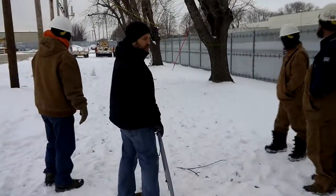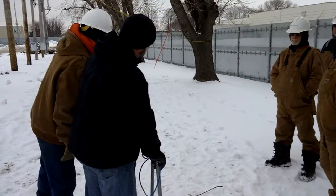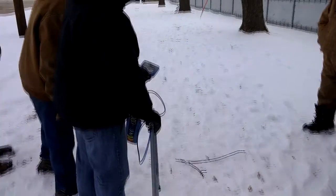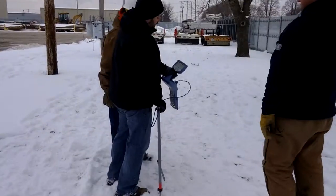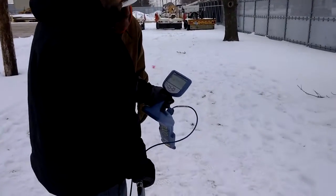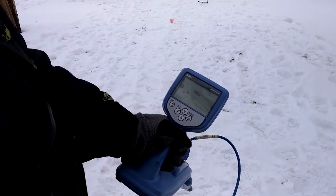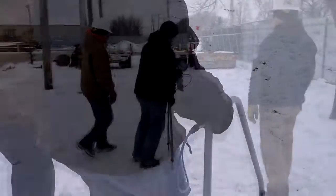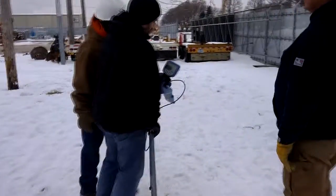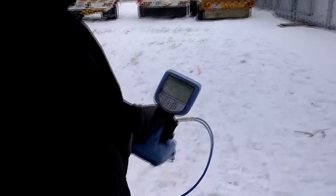You can see we already have red marks on the ground, so somebody's already located the path. Now I'm getting a 43 to 45 decibel reading and it's still telling me to go forward, so I'll keep going. Still telling me forward, about the same decibel level, high 30s. I'm plateauing, which means I'm about halfway there. Still about a 42 — low 40s, high 30s — still telling me to go forward.